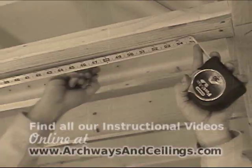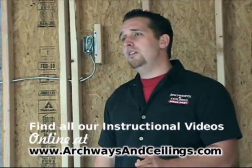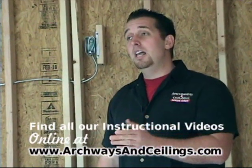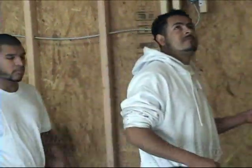We've shown you videos on how to measure, how to install, and today we're going to show you how to drywall. But before we get started, we always suggest using a double layer of quarter inch flexible drywall. It's quick and it's easy. However, if you want to use half inch, we're going to show you tips along the way to get that to bend. So come in, guys. Let's get ready to drywall the ceiling.